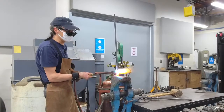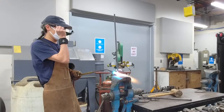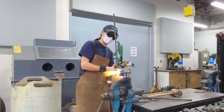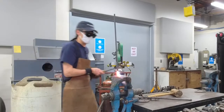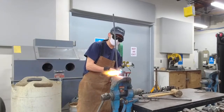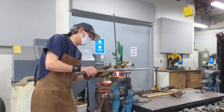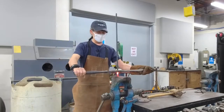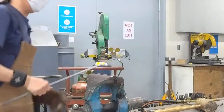I'm looking for that nice orange to yellow color. I'm going to clamp the wrench on there and twist the steel. It really shows how plastic the material becomes once it's heated up. The steel is 3/8 inch thick, which relatively speaking is not that thick, so I've got to work kind of quickly — literally while the iron is hot, or the steel in this case.